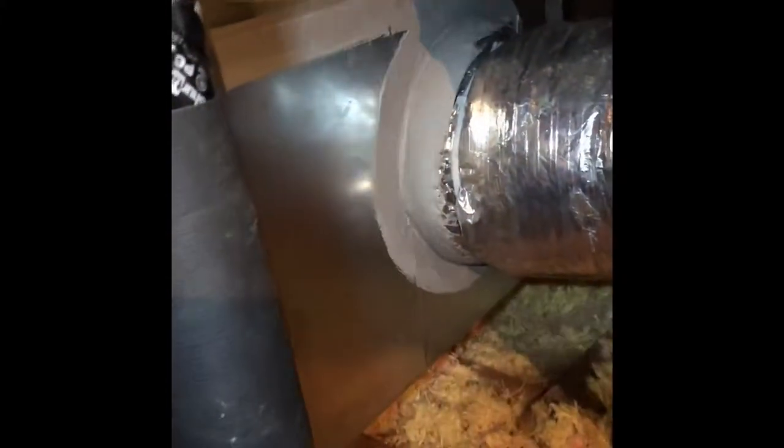It's a flush collar with a gasket on it to prevent air leaks — really good work. As you can see, we've got two access panels on this. The ANSI standards for maintenance require that if you clean the coil, you clean it from both sides. So as a standard practice, we've gone to installing two access panels so that in the future when we come back to clean it, we can clean both the front and the back side.